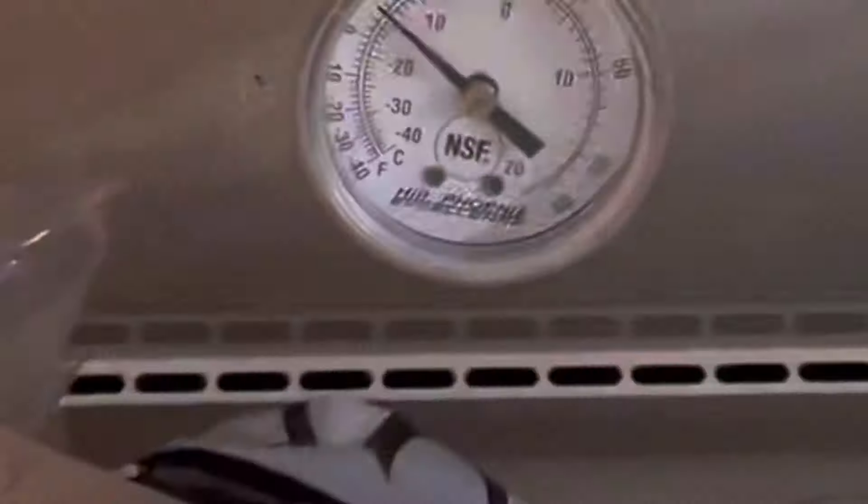So guys, as you can see, the case temperature is down — it's still dropping. Like I said, we got heat in that case but it's still dropping. I was thinking about skipping the defrost time, but because I want to shut the unit off, I'm going to just put it in defrost so the compressor and fans will be off, and then I'm going to rinse it down.